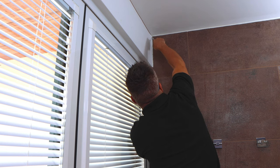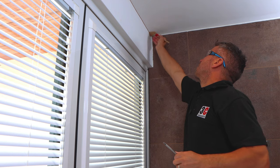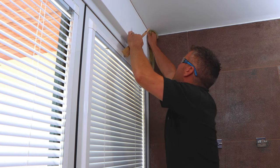Take your old screwdriver and start to rake out that crack, removing any loose debris. As mentioned earlier, the deeper we can get that, the more caulk we can get in, which will bond better. Once you've removed it, take your paintbrush to remove all the dust and give it a good wipe down with a damp cloth, then a dry cloth.